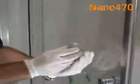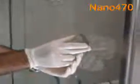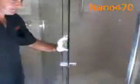Now, following our design on the glass, we just gently put the bevel down. By doing it gently and not dropping it, we don't cause any bubbles. And as you can see, that adhesive wave is just flowing up and over that top edge. So with our 2 fingers, we're just going to hold it into position. As you can see, the adhesive is running down. You just hold it into position and get our light from the back side of the bevel.